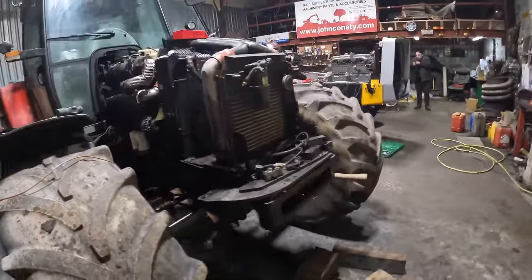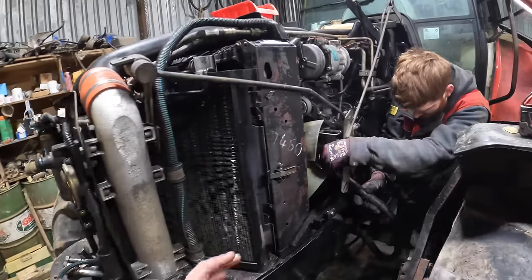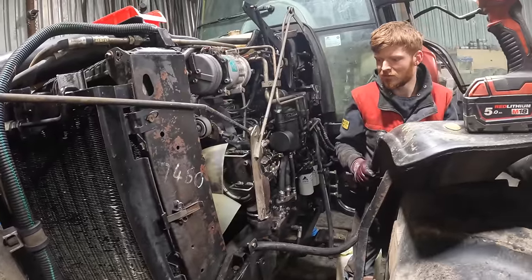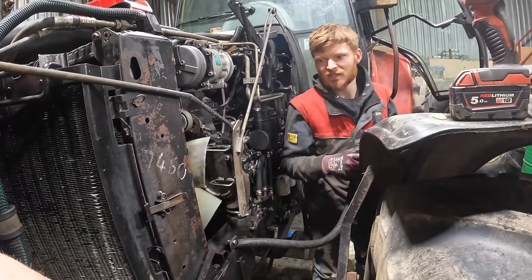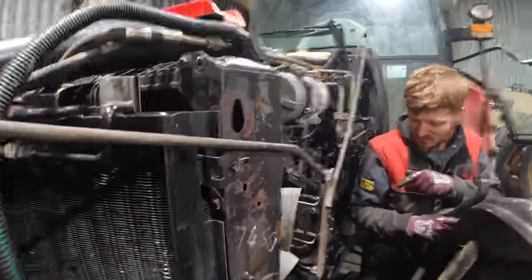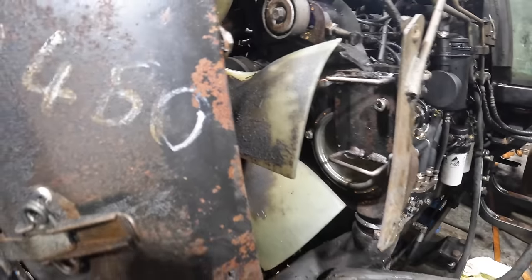So the next job is we're going to be heading for the front crankshaft seal. So now that means taking out the water pump, taking out the radiators. Haven't decided yet. No, because I took the radiator out of the 62 now, to be fair. Maybe get away with pulling the fan. Pull the fan off, undo the bolts and just run her forward. Might be enough. I think I took the fan out, we'll just get a bit more room possibly.